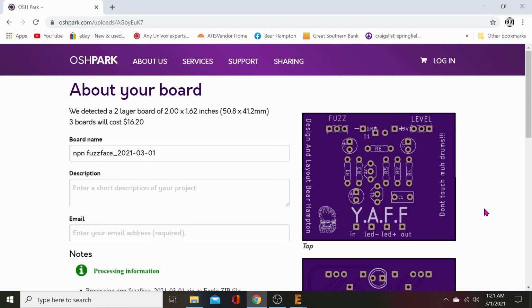So instead, just do it the way I did. Get that latest CAM file, 9.6 or whatever that's in there, OSH Park 2 layer 9.7. Pull that in, and set your directory paths in your control panel like I showed you earlier. Set it there so it'll pull straight up to it whenever you run a CAM job.